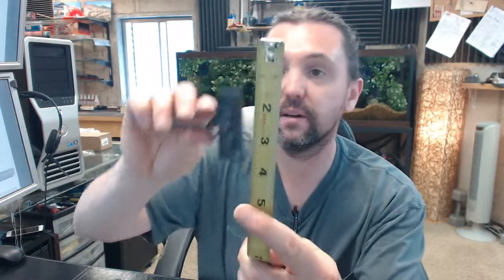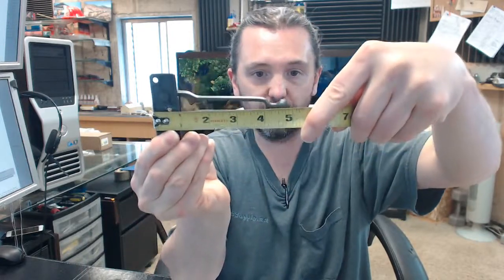Dimensionally, almost everything important is on the dimensional drawing, but the height of the base is 2 and 9/16ths inches, the width of the base is about 7/8ths, and the overall width of the door guard itself is about 4 and 7/8ths inches. Projection off the face of the frame is just about an inch.